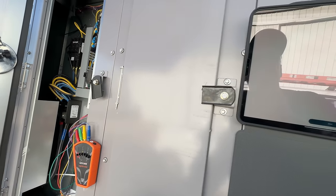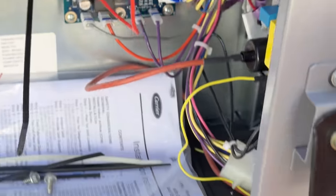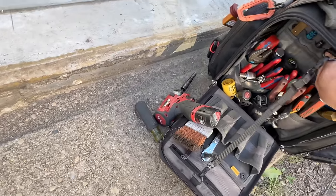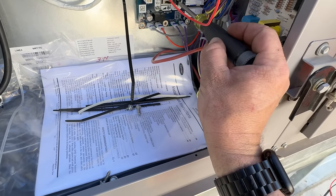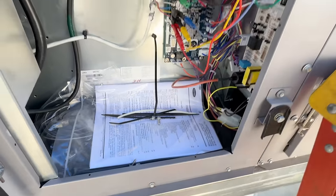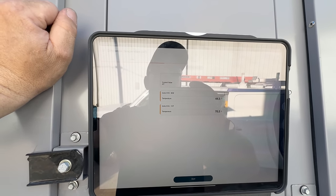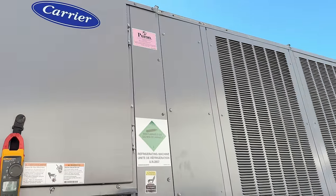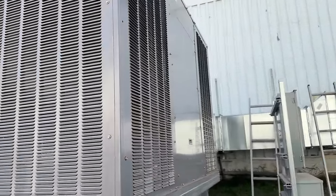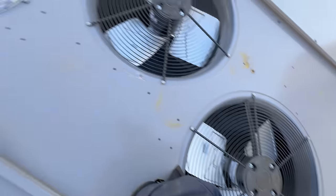Let's see what it is on high. We are on C there — we can speed that up a touch. We're just blasting through this one. Knowing where everything was going to need to be set made it go much quicker this go-around. We had it 50% before, let's go ahead and maybe go 60% there and see if that puts things a little more reasonable. That's bringing it down more reasonable — we're getting some actual latent and sensible both. Starting to hear noises from the fans. I figured that would have been a fluke but it must be a total issue. I'm wondering if one of those wires is hitting — last time it was that one acting stupid, this time it's this one.